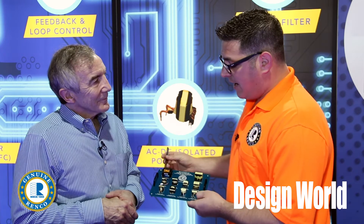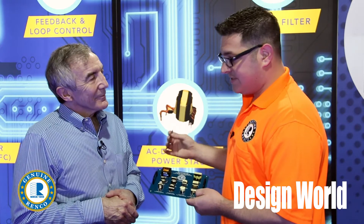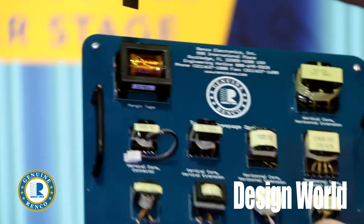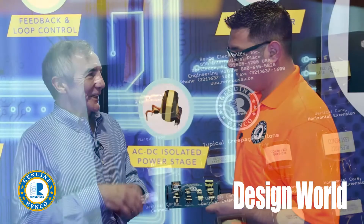One other thing to mention: we have all these different packages with triple insulated wire — that's a little bit new school. We still have an old school approach where we wind transformers with margins on each side. This is another way to accomplish creepage and clearance, getting those margins inside the winding window.